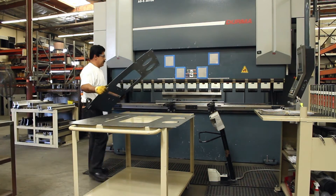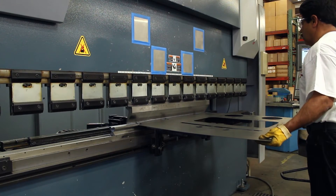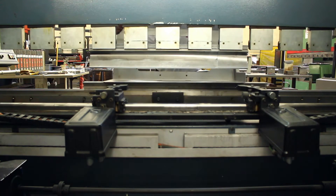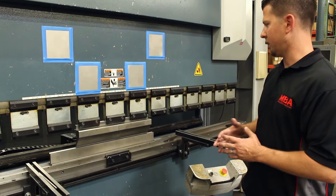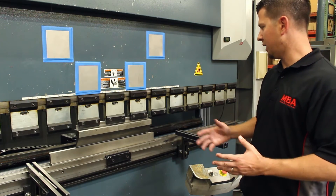What this does is it takes the material — the top die will come down and bend the sheet metal around it. It actually doesn't bottom out and compress the material. It's called an air bend, so it actually just kind of bends it on the bottom die bed. All designed in the engineering office, programmed to make the best possible machine, the cleanest possible machine.